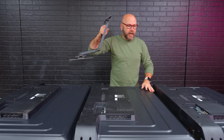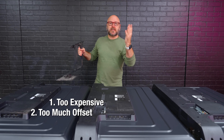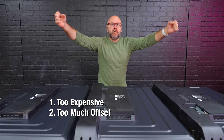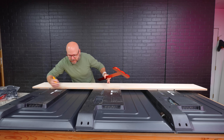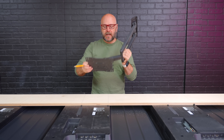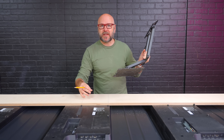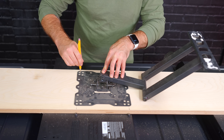I'm not going to use a wall hanger — three reasons. One, these TVs are going to be hung vertically and vertical TV wall hangers are ridiculously expensive. Two, that's going to offset it from the wall more than I want. And three, I want this whole unit to come off the wall as one piece. I've got my TVs all butted together, marking where the screw holes are, then drawing a line down the board. I'm using the existing wall hanger to mark the four holes. If you don't have one, you can download templates or poke holes in paper to transfer them.